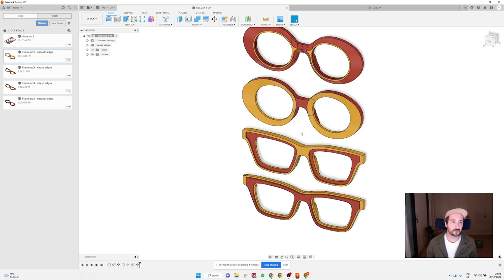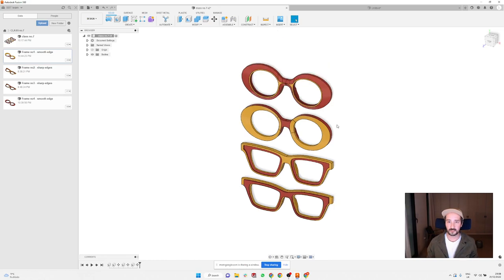And I'm going to show you afterwards how to create the manufacturing process and the G code for both front and back, and how to ensure that you don't have a problem with finding your zero properly, and when you do the machining first on the front and then the back, how to make it perfectly aligned. So we can jump to it.